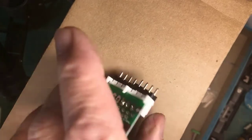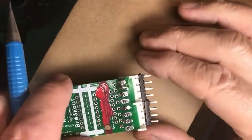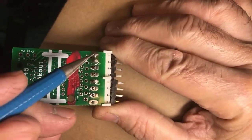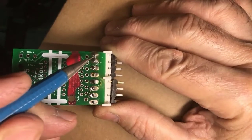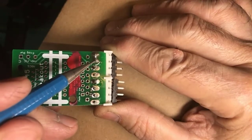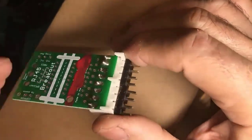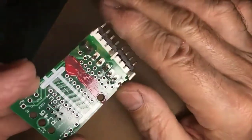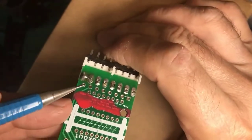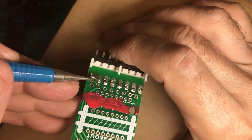My go-wrong demonstrator is this guy here. And it shows some of the popular failures that one can have. All right, you notice how the solder is going between the two traces? Got excited, poured too much solder in, and the solder went across and connected to the other trace. This is called a solder bridge, and obviously is not going to bring happiness to anybody, but that's something to avoid. And it's one, use fine diameter solder. Two, don't try to solder two traces at the same time, because you may end up with two traces soldered together.